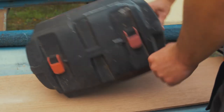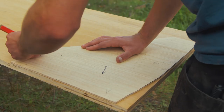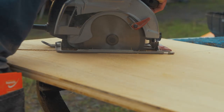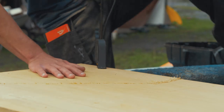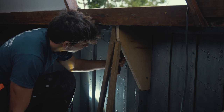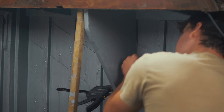The starboard and port deck is leaking — yes, it's disheartening — but I'm just taking it step by step. It called for making bigger supports. It won't stop the deck from flexing, but it will minimize it. As I'm recording this voiceover in the boat, I just finished securing the last of the deck supports. I'll have to do one or two more where older supports were broken and people cut them out. You just make the press to fit the supports rather than cut the supports. Then I'll move up to the mid cabin and after that to the V-berth.